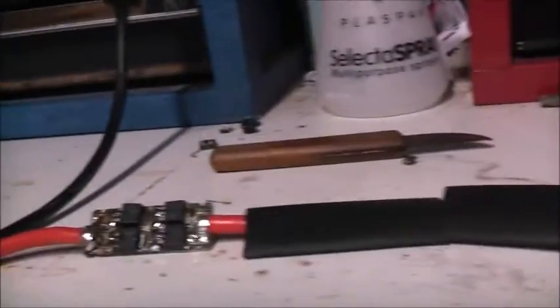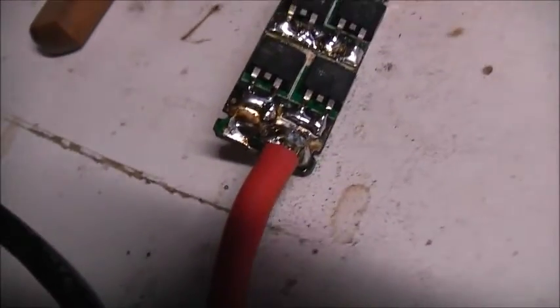I've got to get the right soldering irons. I might have to start buying up every soldering iron. Me cheap ones I've got in storage with a big tip - I'll grind a nice chisel point on one of my old ones. The Hakko one, I don't think that's high enough wattage and I haven't got a chisel point for that one. But one of the other cheap ones I've got - I'll make a chisel point for that. That'd be perfect - I think that's an 80 to 100 watt range soldering iron. That'd be perfect for this.